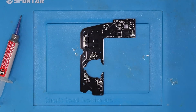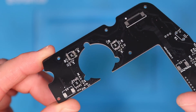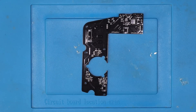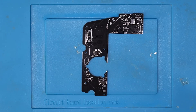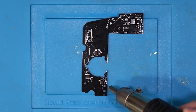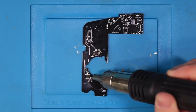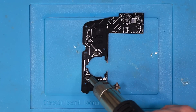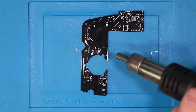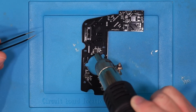Next up is the right front controller PCB. I'm going to follow the same basic process as the previous one: small surface mount components first, then ribbon connectors and then the larger items at the end. The hardest part to solder on this board is the HUSB238 IC as it has an exposed pad underneath, so you really need to use a hot air station for this one. All of the passive components around it are to configure the correct voltage and current from the USB-C port, so make sure you get the exact right values for these components. I find the switches don't appreciate being covered in PCB cleaning solution, so I'll give this board a soak now to remove the flux before I solder them on.